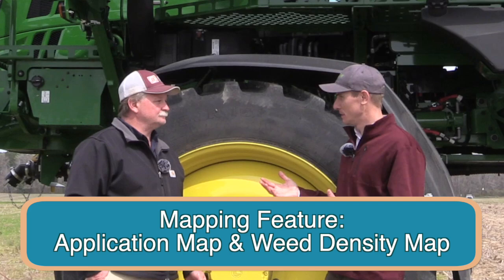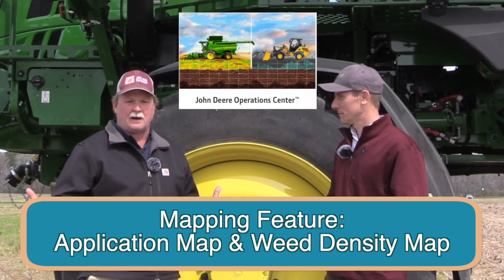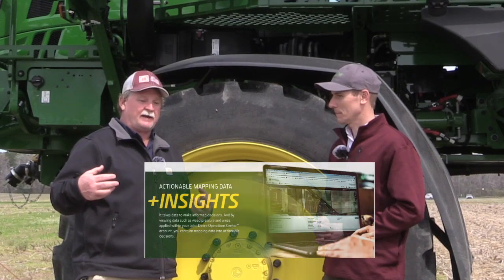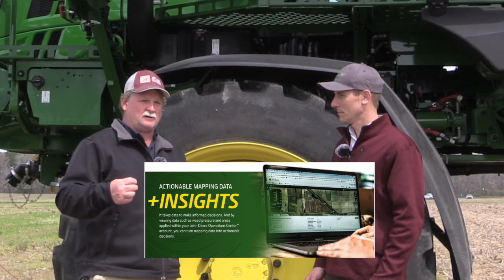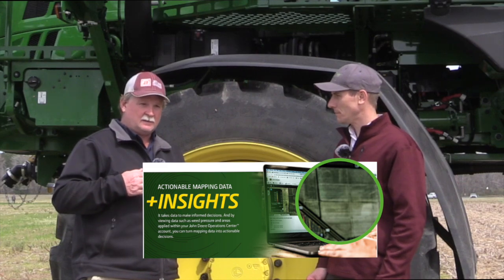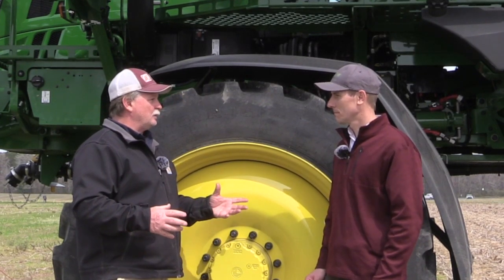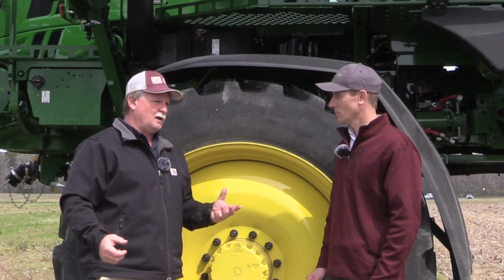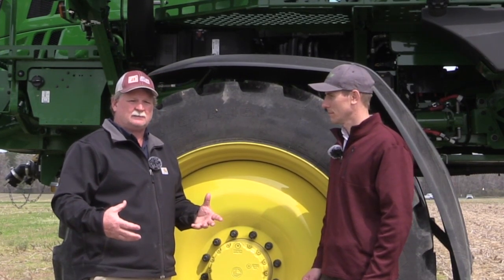This equipment generates a map when you're done — how exactly does that work? This machine is connected to John Deere Operations Center. Every four seconds it's feeding information to the operations center and generating a map, which you can watch almost in real time from your phone, computer, or tablet. Every time the sprayer turns on and sprays, it makes a red dot on the map where your weed is. You can look back at the map and say, 'Why do I have so many weeds in this one spot?' and use that to identify whether you missed a pre-application of herbicide or have a crop stand issue.